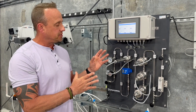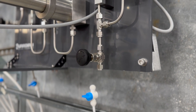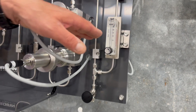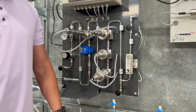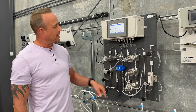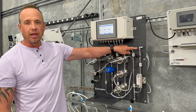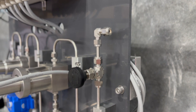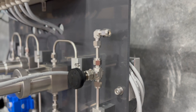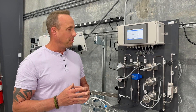You'll see there's a small sample valve here for typical daily boiler operations and sample testing, as well as your inline rotameter or sample flow control, where you can dial in your flow control and track your reading on the live display of sample flow. The sample outlet should go to atmosphere at a very low flow rate. You can operate this panel at a flow rate as low as 50 mils per minute to a maximum of about 500 mils per minute.